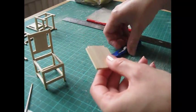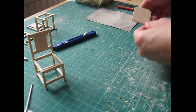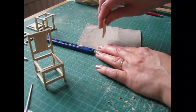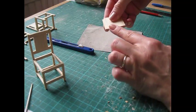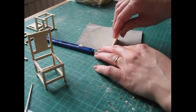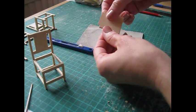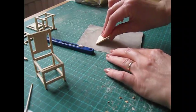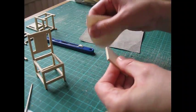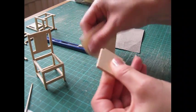Now shape the edges and the front edge of the seat, just to make it look a little bit nicer. Hold it against your sandpaper and gently sweep it towards you, bringing it into an upright position — this rounds off the front edge without taking away any depth. Do that on each side as well, just very lightly. Then tidy up with a scrap of sandpaper and slightly round off the corners so they don't look so sharp.